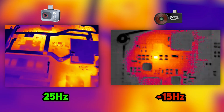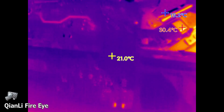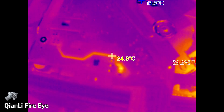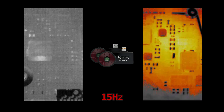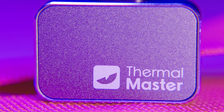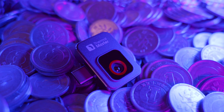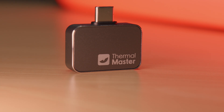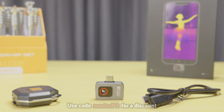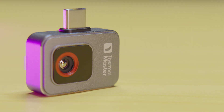As my use case is electronics repair, the main function for a thermal camera is to detect shorts. Sometimes faults are only present for a short period, as they can be faults on secondary rails that go off quickly within the power-on sequence. Low refresh rate imagers are annoying to use as you'd often miss these brief glimpses into what's going on — something easily mitigated by higher frame rates. To sum up, this is a great value thermal imager for both repair shops and hobbyists, with a lean towards hobbyists. The 25Hz refresh rate, although not the fastest, is still ample and even advantageous compared to older, more expensive units. I just wish there was a way to adjust the focus and some protection for the delicate lens assembly, and macro upgrade options would be nice. If you're interested in this camera, I've linked it below with a discount code. If you like this video and want more tool reviews, let me know in the comments, don't forget to subscribe, and until next time — see ya!